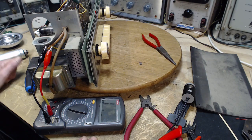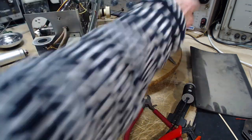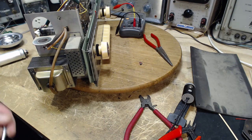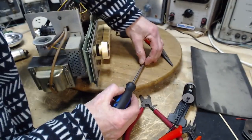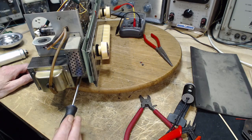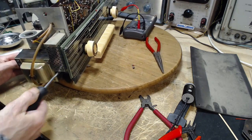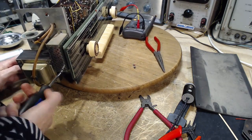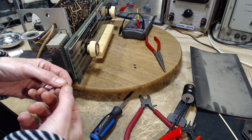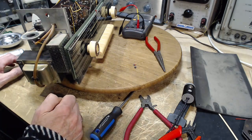The can has to come off, that's for sure. I made that a necessary thing now. It appears as if the resistor has gone open. It would be the connection to the resistor. Appears to have gone open. Is that it? Okay, regardless of the troubles to come. So what's happened is the red paint is holding the nut on the screw and the whole thing's turning as a unit and it's not coming loose. Can't get a grip on it that I can see.